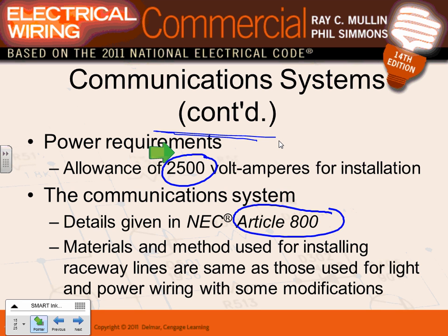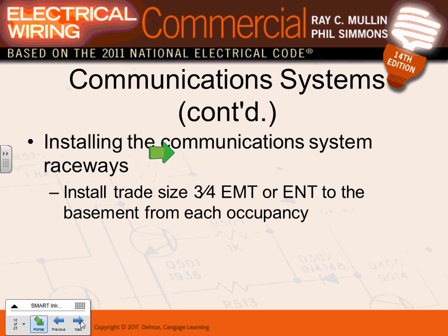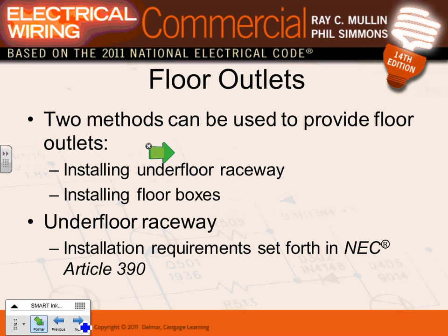There's no difference between installing a conduit for a lighting circuit versus a phone line — EMT is EMT. For communication systems they typically install EMT conduit, a square box with three-quarter inch knockout, and leave it for the low-voltage contractor. ENT — electrical non-metallic tubing — is also a good application, especially in highly corrosive environments where you don't want steel.